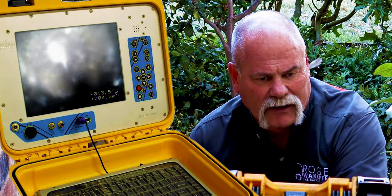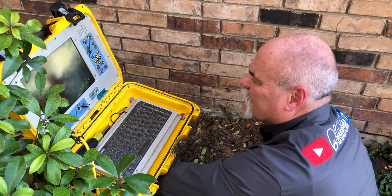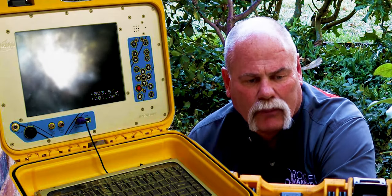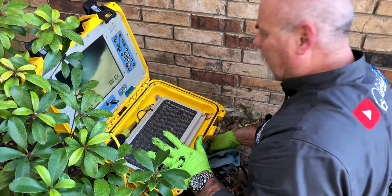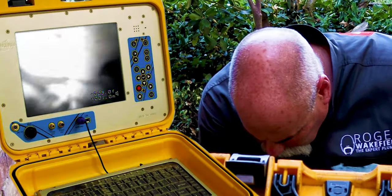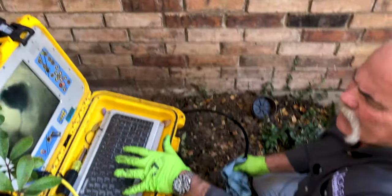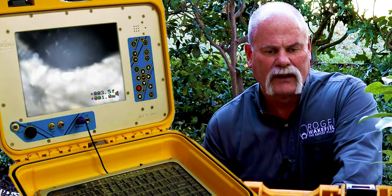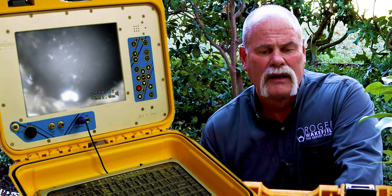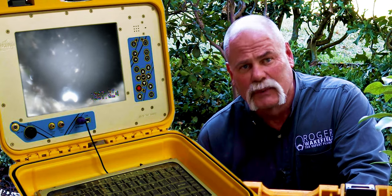I can see roots and stuff right there like we talked about. There are a couple of areas that don't look great. But if I was buying this house, I wouldn't have any problem with this sewer. I would probably want to dig up this two-way clean out and get it replaced — I know it's holding water and we can prove that, it's easy to see. Coming up through the clean out, I don't see anything major, just a little water coming down the side, no breaks. The only thing that scares me is that the two-way clean out should not be holding water in the bottom — it's not level, it's either got back fall or a break or something. That's something I would want addressed because I don't want to have to clean out this sewer every other month just because of this issue.